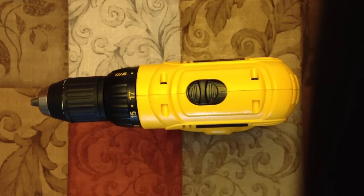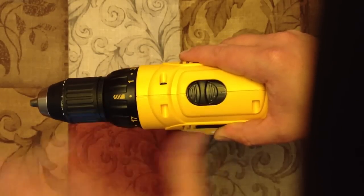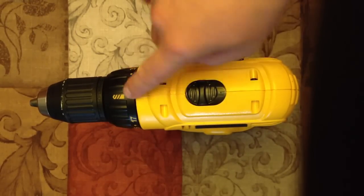When I first saw 17 settings I thought, why would I need that many? But they do come in handy. If you're drilling a screw into a 2x4, you'll want something like 14, 15, or 16 depending on your desired depth. When you're doing a lot of the same thing — building a fence or a deck — you find that torque 10 gets you about where you want, so you set it at 10 and run with it. It'll stop right about there and keep you from driving the screw in too far.